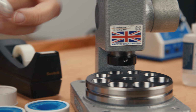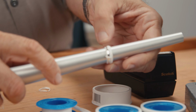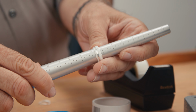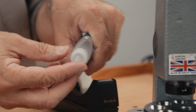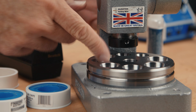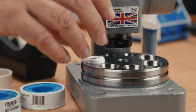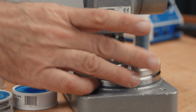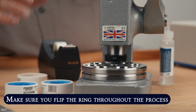And let's check and see where we're at right now. And if it comes off, it's okay. Go ahead and rewrap it. So we're already down about a half a size. Put a little bit of the lubricant inside the die cup. That helps it slide a little bit easier. Push it in there, slide it under, give it a tap.